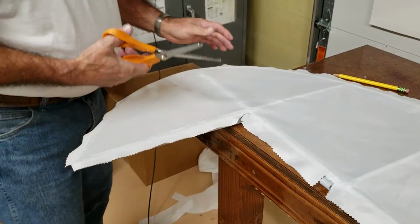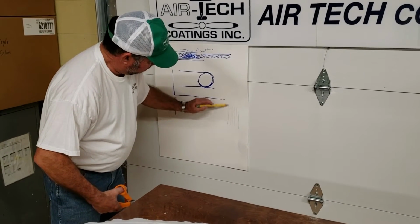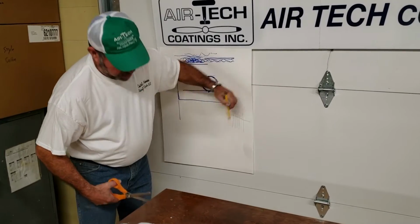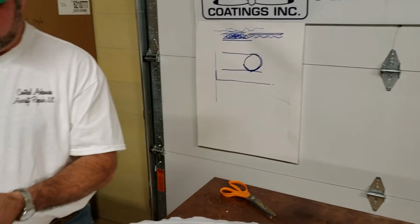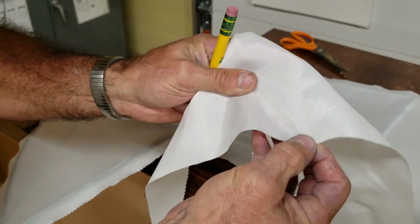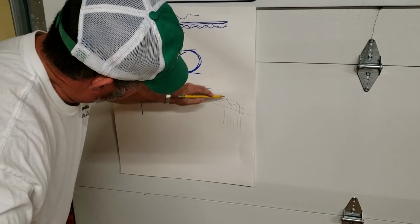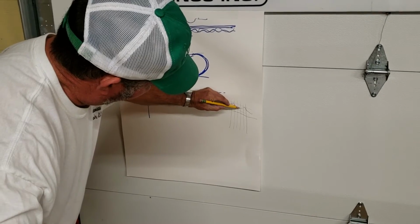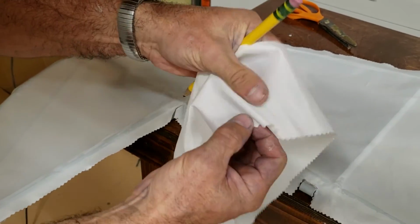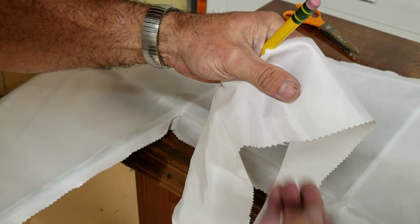Just to cover this real quick on the pinking shears. Everyone knows this, but the way a pinking shear works, let's just say your fabric, you've got weaves running this way, you've got weaves running this way. If I take a razor blade and I cut this, and I'm kind of coming in and out and in and out, these ends on a straight edge, see the way that's doing? And see, I'm just pulling more of those out, and it just makes a mess, and I'm pulling more of those out. When you pink the edge, you are essentially pinking the edge so that when this string comes out, it's going to stop there and it's going to stop there. This string's going to stop there and stop there. So the worst case scenario on a pinked edge where I was pulling these parts out is just the very tip of that would ever come out. Now, it's going to be a little fuzz from it, but unless you get to pulling it all the way down to the base of that, and then you start pulling it out.